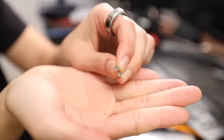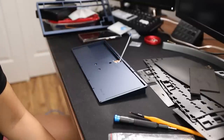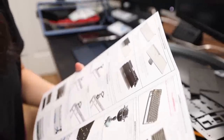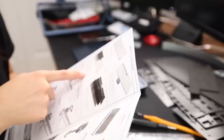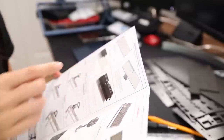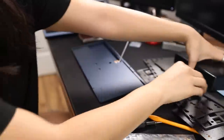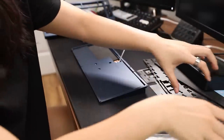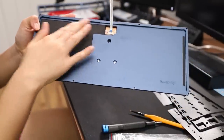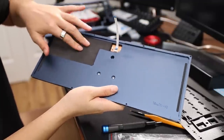There are two little tiny screws here, and someone's doing some construction outside, but that's okay. Looking at the guide just to be sure. Step three: screw in the Type-C daughterboard. Put 3mm foam into battery room. Let's screw that in. Since I'm not using the Bluetooth functionality, I'm just gonna fill the battery room with this foam so you don't get noise echoing where the battery should be.